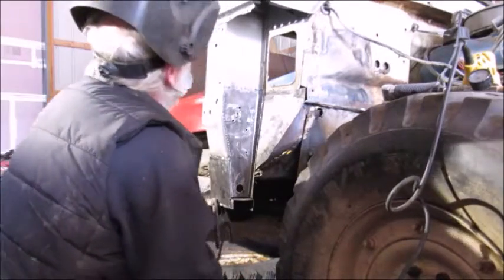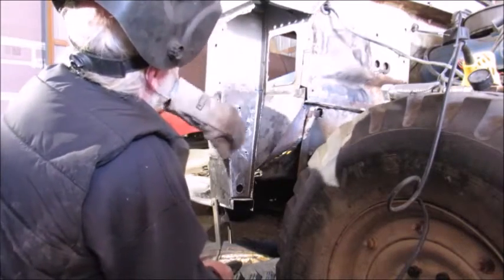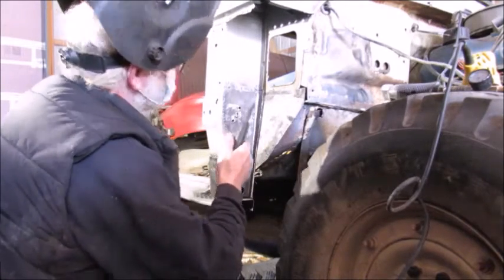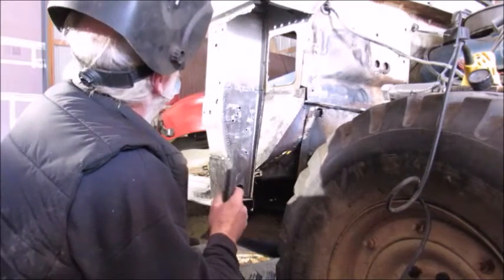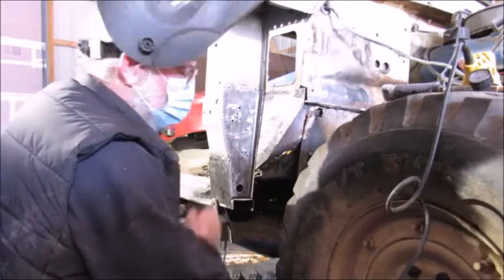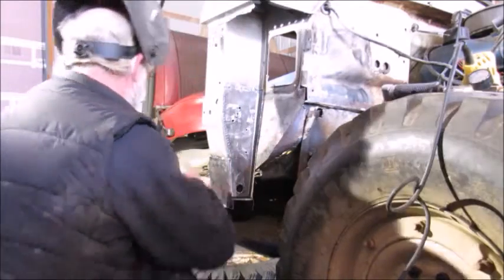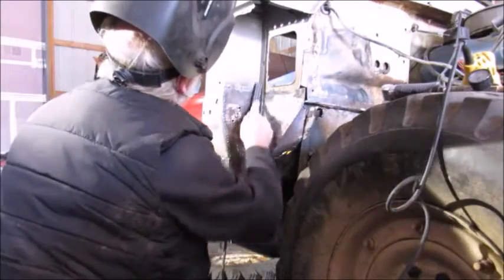Okay, so once again, I don't know how well you can tell, but my wire kept going through the hole, or it wasn't, I'm gonna call it igniting when I touch the metal. When you're unable to get the spark going with flux core wire, it's because the area that you're welding is dirty. In other words, it probably has slag on it.